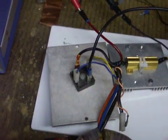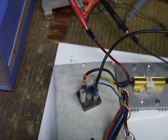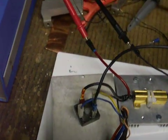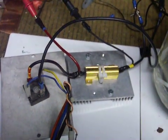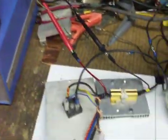Then the toroid goes to my full wave rectifier. At the rectifier I have DC about 80 volts coming out. Then I have my series shunt for measuring current — this is a 0.1 ohm resistor, those leads going up to this multimeter. Right now it's registering 33 milliamps driving to the plates.